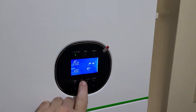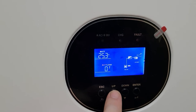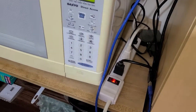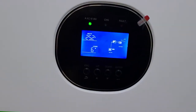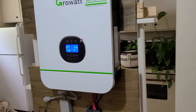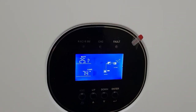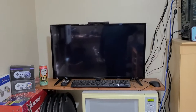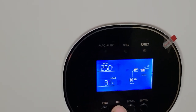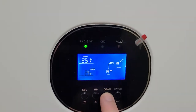If I scroll through the menu settings here, you can see the load right now is at zero watts. And if I power this on, it shows a very basic load of 30 watts. Then I'll power on the PC — and then we're jumping up to 93, almost 100 watts. Like I said, this is a 3000 watt inverter, so for a load of 100 watts it's only at 3.5%. We're using hardly anything right now.